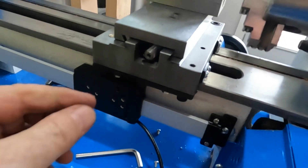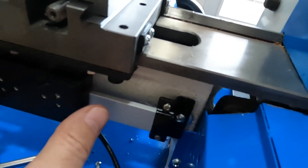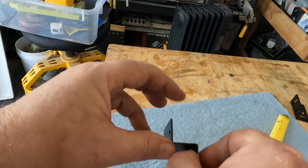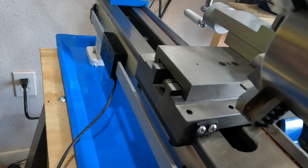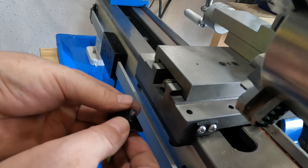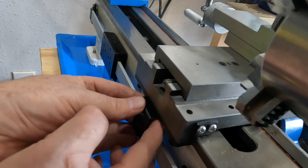Now I need to make a little bracket. I'm going to take this screw out and have a little bracket that connects to these little screw holes so it'll pull the reader back and forth with the carriage. I think I can use the bracket that came with it — I'll bend it straight and adjust it. I drilled it out and made it sort of an L-shape, then put it in here, put it up, and put the bolt back in the carriage — the piece that holds it to the lathe bed and the ways.